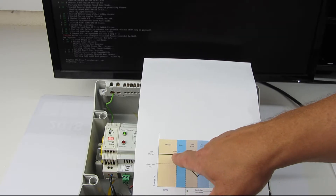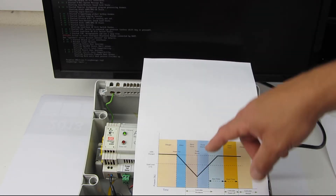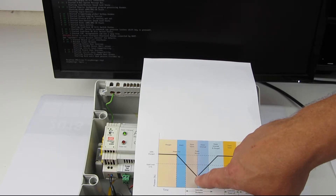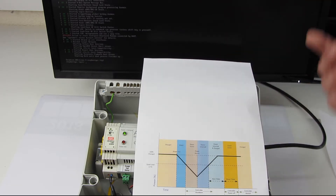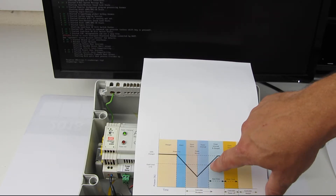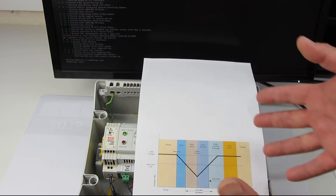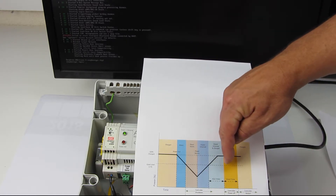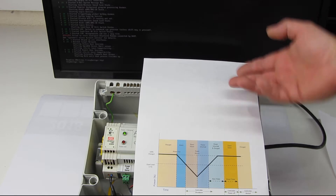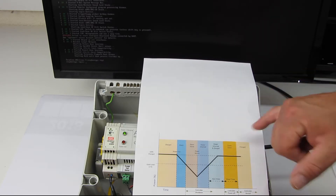The second scenario: we go down below the power good level, we inform the client — for instance the Raspberry Pi — and the Raspberry Pi shuts down. Now the power returns. We have to restart the client. In this case we wait until we are back up to the good level. Once we reach the good level, we switch off the power of the client for a while, and after that we switch the power on again and the client starts up again. This is the time window where the client is down and then starts again.